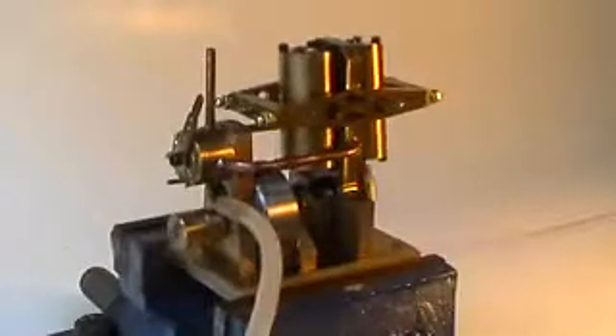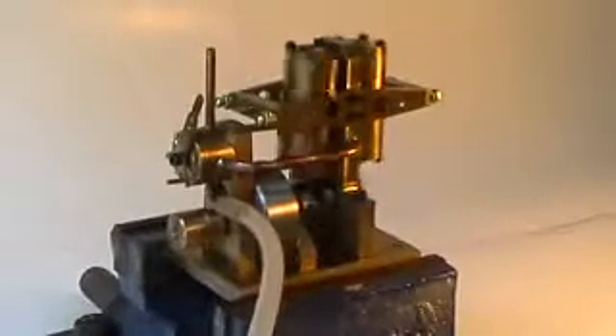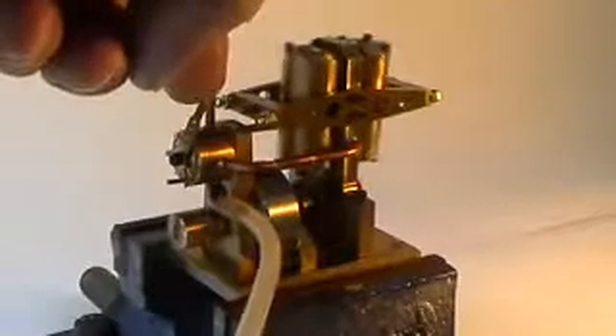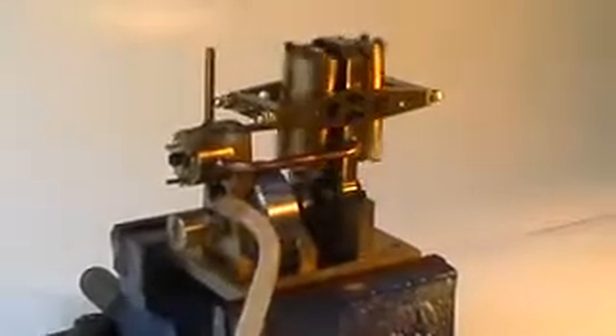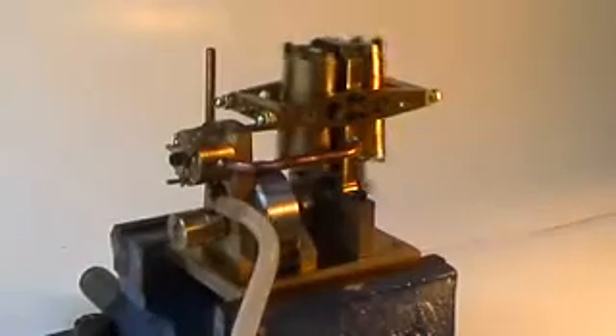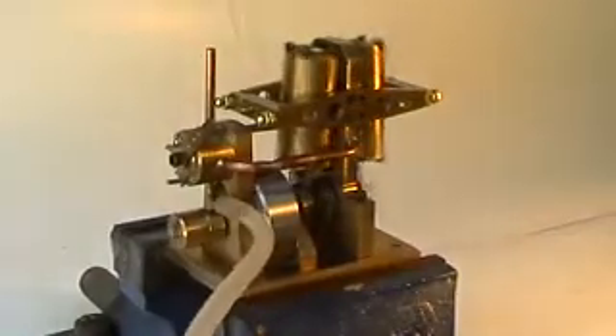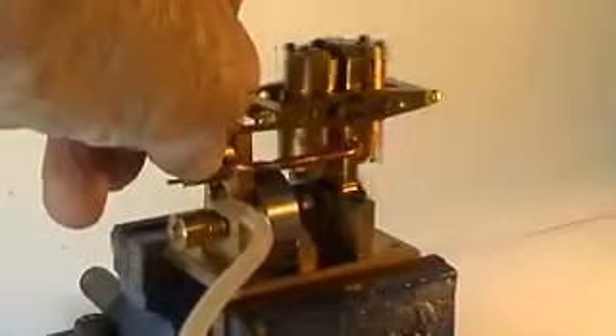But that has to be done later. It does hang up occasionally slightly, and this is because the faces of the cylinders need to be bedded down just a little bit more against the centre upright. Although I can't feel it when I rotate the engine by hand, it seems quite steady. You can see it starting and stopping quite easily there, but there must be some small resistance somewhere.